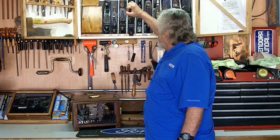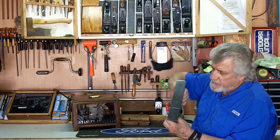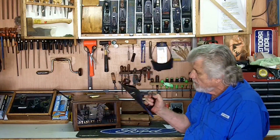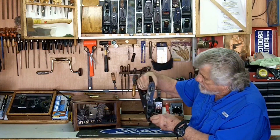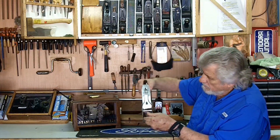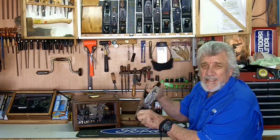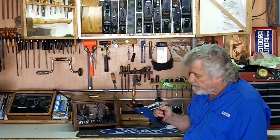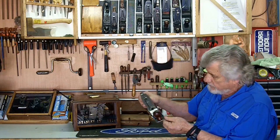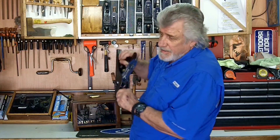Here's a No. 10 — this is a carriage maker's rabbet plane. It's for really getting rid of wood quick. The sides are open so the shavings can come out. This is also a sweetheart on this ten. There's nothing about this rabbet plane that matches like a bench plane — there's no frog adjustment or patents on it. But I know it's a sweetheart because it's between 1919 and 1933.